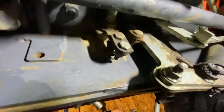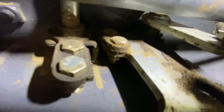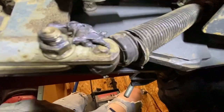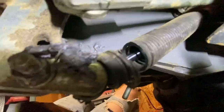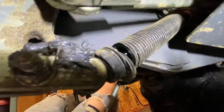As I move the pedal back and forth you can see those pedals are connected to a rod that goes through the frame. When you grease it — there's a grease fitting there — it's greasing that rod that goes to the frame, keeping the pedal travel smooth. After that rod goes through the frame it goes to a bracket, then to a shock dampener. That dampener allows the pedal to retract at a smooth pace so you're not abruptly stopping. If you let off your HST pedal and notice your tractor abruptly stopping, you'll want to replace that shock dampener.